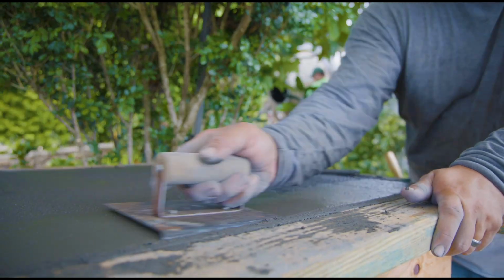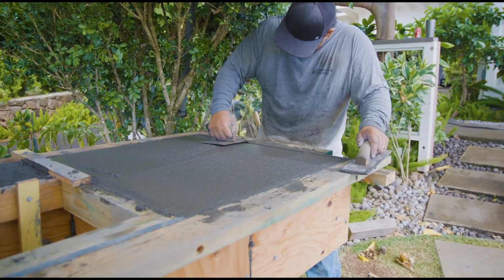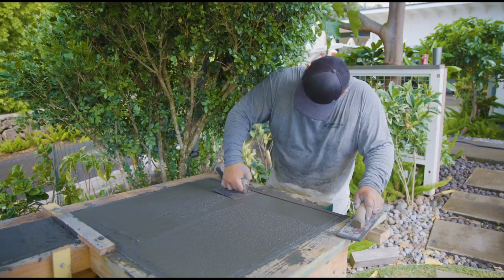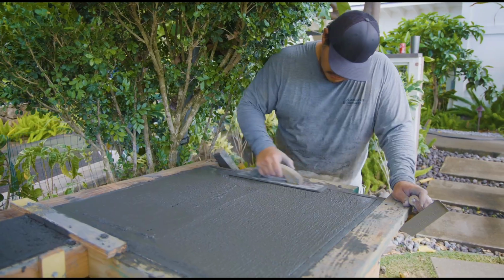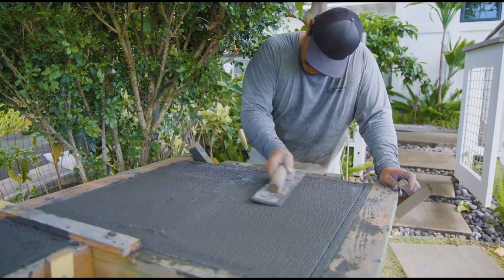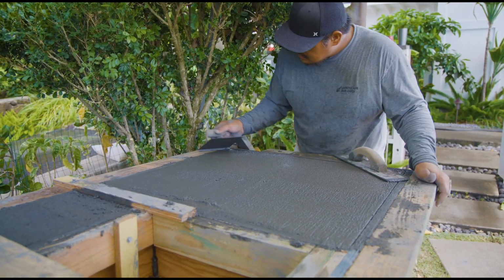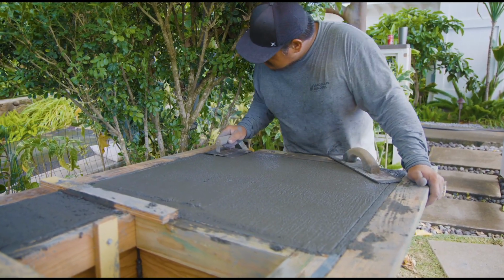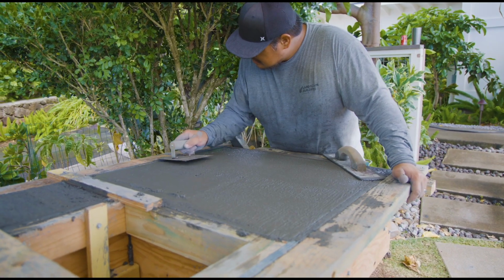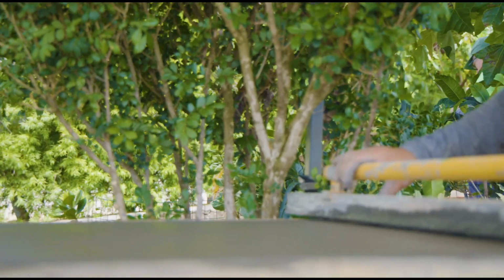We are using 1/4 inch edge or 1/4 inch radius edge on all the forms. The 1/4 inch in comparison to a 3/8 or 1/2 inch makes it a little bit tighter. More like an inside counter, which would be a square 90. A square 90 is really hard to use. You'll see a lot of the Australians, very high-end finishes using that. We find this is the best for us. The 90-degree square edges, the tools aren't as readily available, and we're just not as good at using it yet. So we tend to use a 1/4 inch, which still gives us a nice, tight finish.